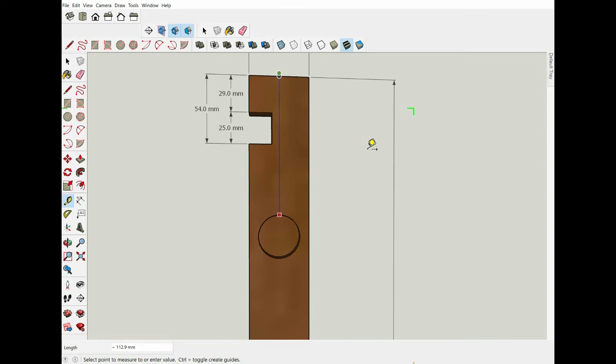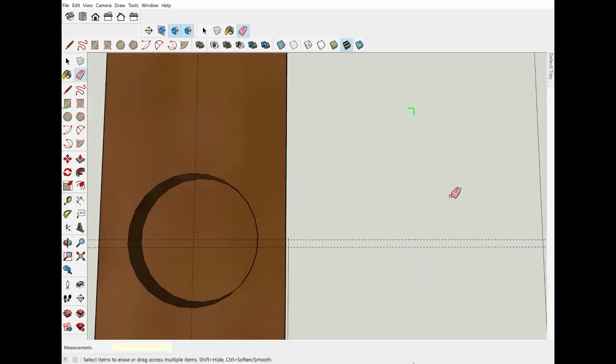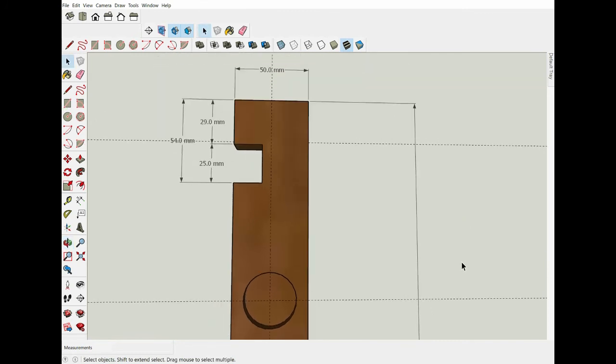So what I'm doing right now is dimensioning where I want the hole. And I'm not going to dimension to the top or the bottom of the hole because I have to do a calculation. When I go to make this, I want to know where the center of my hole is. And kind of eyeballing it there, that looks to be a little off center. I'm not going to trust my measurement from visual though. I am going to check it. I've got 4 directions that I'll check it in, and it does look like I'm off. So I'm going to slightly tweak that so that I get the proper dimensioned spot. That gives me the center point of my circle, and it allows me to drill it.